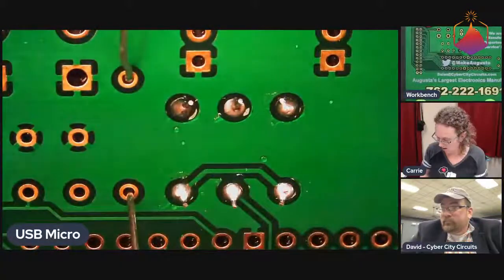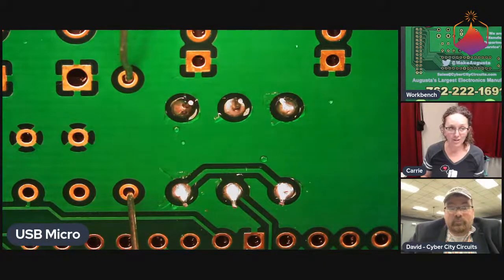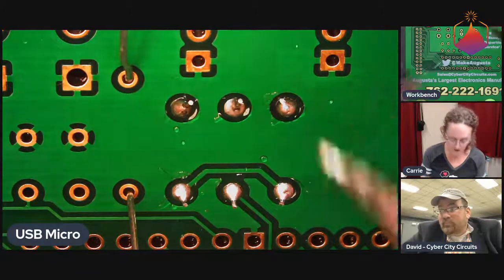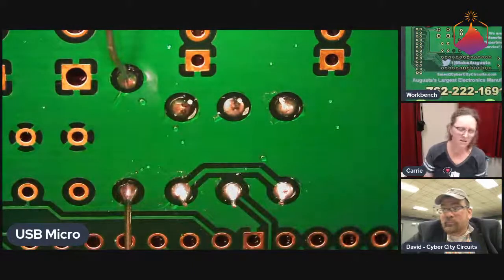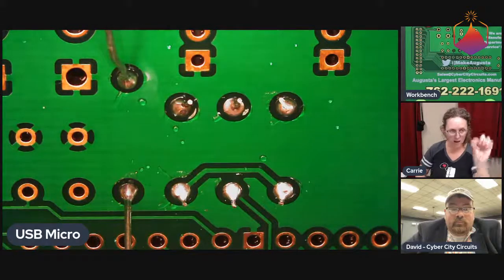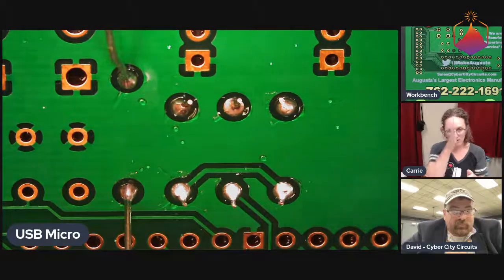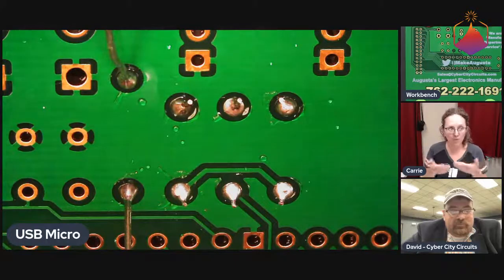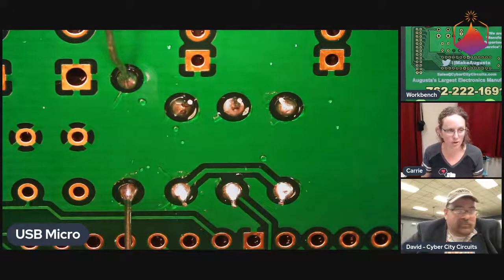I myself am always frustrated about, I love all of the digital IO, but I hate that there are only a couple of power and ground pins. So I'm thinking of doing something similar that's a solder-it-yourself kit, but with servo-style headers, just so that you have the row and the IO down the outside. So you could still make it in a shield format. You would have the IO down the outside, 5 volts or VCC in the middle, and ground on one side. That way you can actually wire it to all of the things that need wiring, since my projects tend to need a fair bit of wiring everywhere.